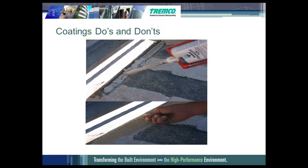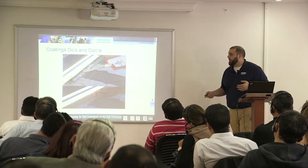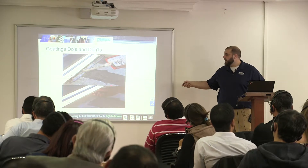This is a situation where there was a large void and they had to structurally anchor something there. We had to use an epoxy because we couldn't use our sealant — the sealant moved more than the requirement they had. To make sure we could bond to that epoxy, we cast sand into it: the epoxy came in, then we broadcast sand over top while it was still wet, so the base coat had something good to bite onto rather than bonding directly to the epoxy itself.